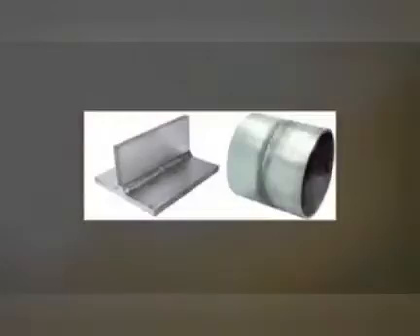Additional tools include cotton rags and weld samples. The procedure is: pre-clean with a cloth dampened with solvent, then apply penetrant to the surface by spraying or brushing. Allow proper dwell time — the penetrant dwell time is between 5 to 45 minutes in every technique.